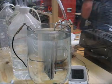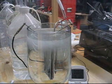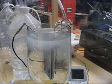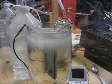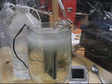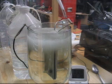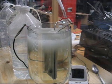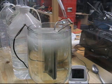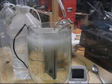I am registering 15 amps. I've got a fairly high concentration of sodium hydroxide in here. At 12 minutes I have 100 degrees in the water, about 20 amps on the ammeter, and I still am not seeing any appreciable amount of scum. I'm not even sure if there is any.